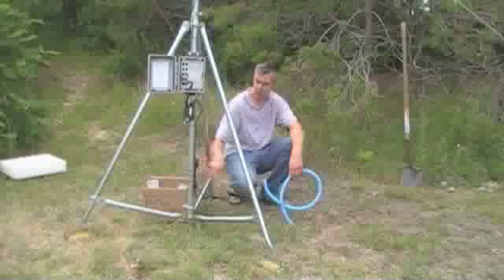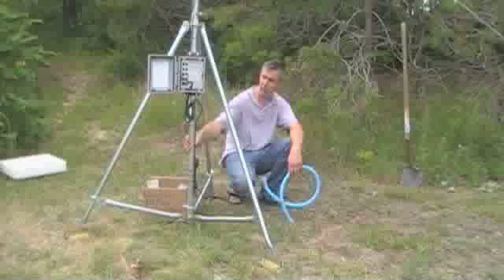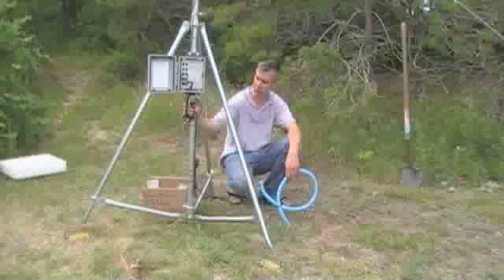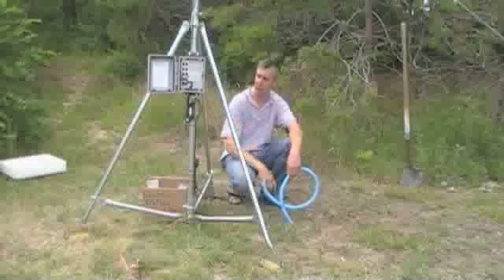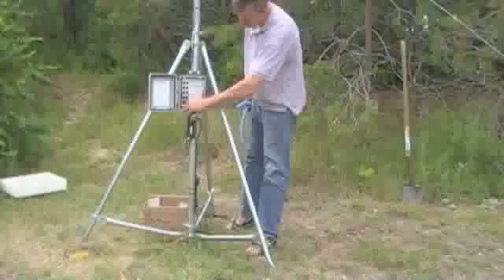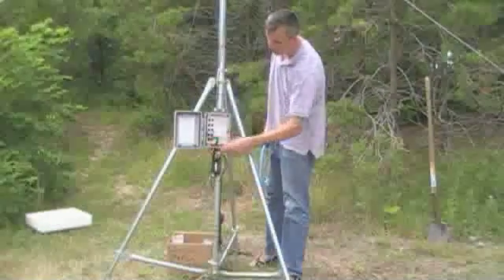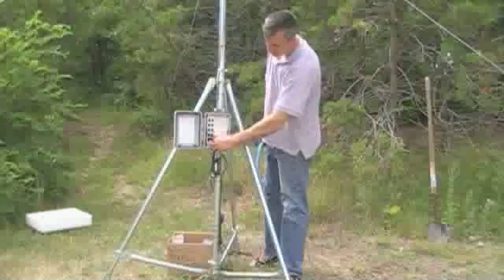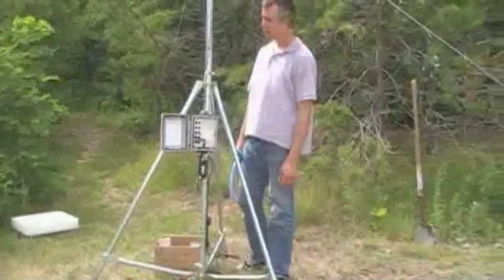You can see that I've got the excess wire bundled here on the lower mast. The devices run up the mast; I've clamped the sensor electronics housings to the mast, run the rest of the cabling into the housing, and sealed off the housing using the black grommet that we provide around the cable so that bugs and moisture won't get in there. I've tie-wrapped all of the cables together to the tie-wrap holder on the logger, and that's pretty much the entire assembly.